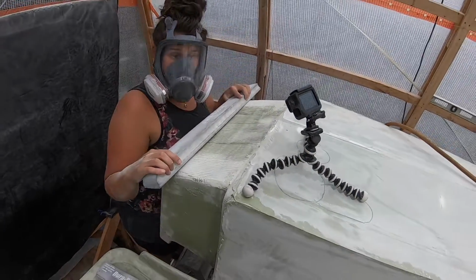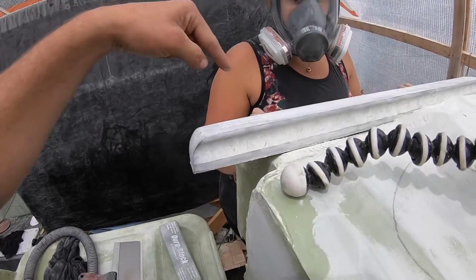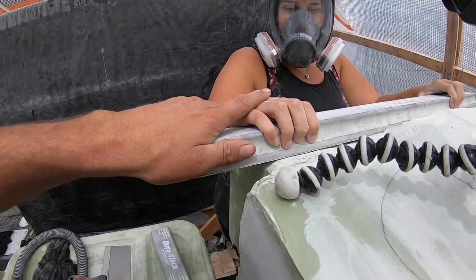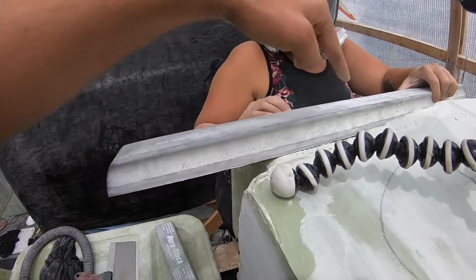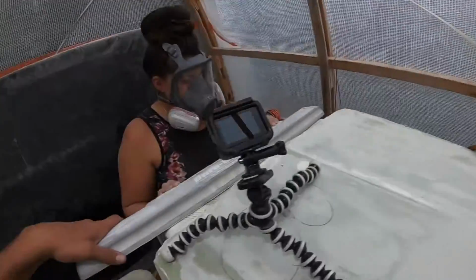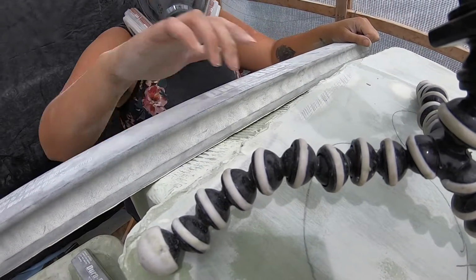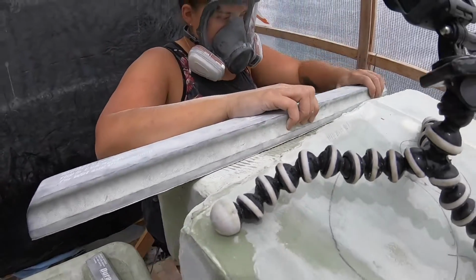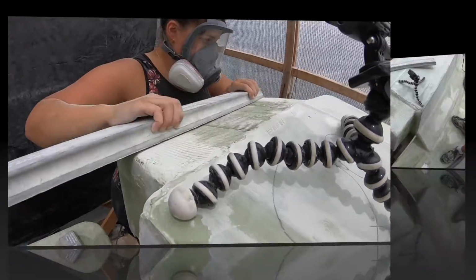Just make sure, for your reference, when you're coming off the edge, did you see how wide your hands just were? Put your hands back on here, the way they were. When you're sanding off the edge, if you're pushing down, it's going to do that. Look at the center of this, it flexes up. Hold that end down. Watch the center now, and very little pressure does that. So just make sure you keep the pressure on the board and you don't run your hands off the edge. You're doing fine, I'm just trying to pay attention.